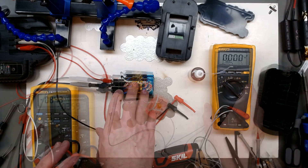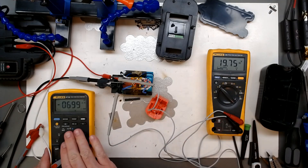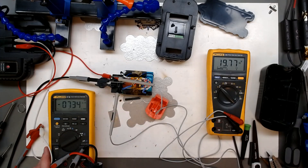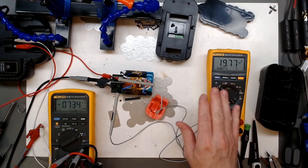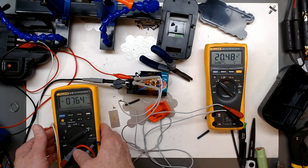Back now about 20 minutes later and we're approaching 20 volts. We've dropped off some on the current. It still has that little bit of a pulse like it does for NiCad. Though it's totally not recommended to do lithiums with a NiCad charger, it actually is seemingly doing okay with the BMS making sure it doesn't over-volt. We'll just keep monitoring and see how it goes - we're getting close to fully charged.